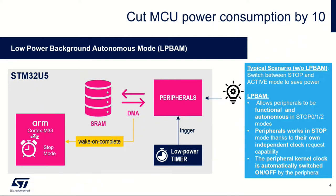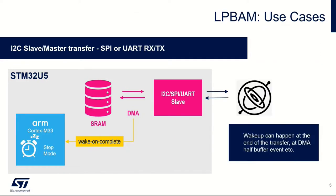To give you an idea of how that can be used, here's a selection of examples. This one is essentially interfacing to some form of external component like a MEMS sensor operating over I2C or SPI, or even a GPS using conventional UART signals. We're using LP BAM and low power DMA to transfer data from the peripheral into memory, and then when the transfer has completed, we can wake up the rest of the device and the MCU core to process that data.